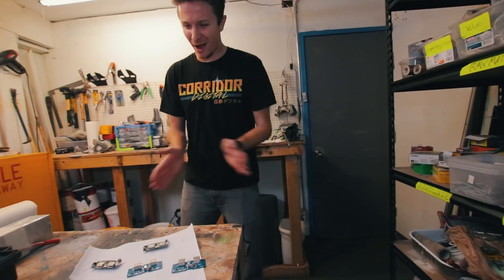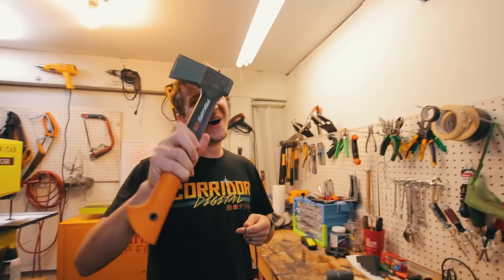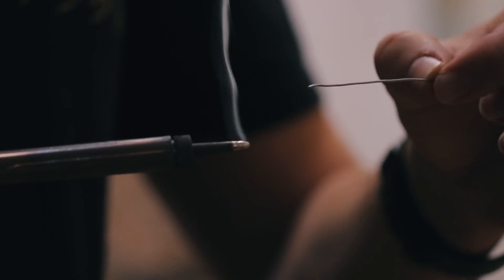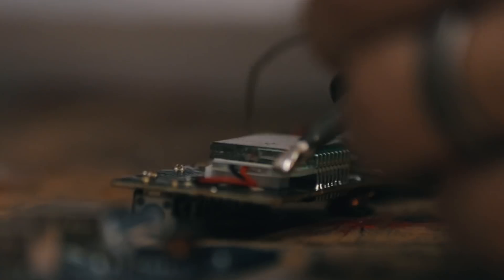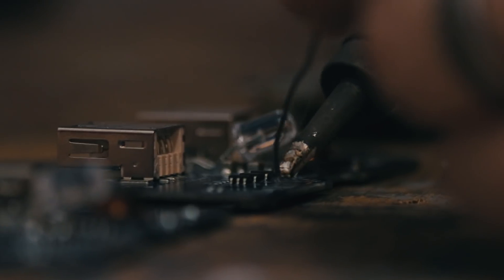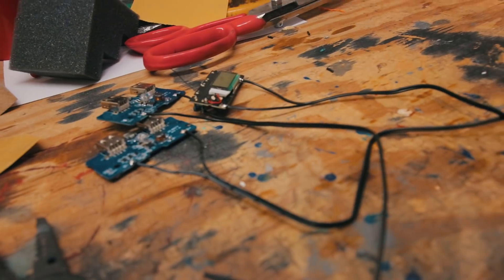A power bank of this size charging eight phones — that's kind of unheard of. The cool thing that allows you to do DIY battery builds like this is that you can buy USB chargers really cheaply online. Each little circuit board has two USBs along with a micro USB to charge. If I wire up four of these circuit boards with two USB ports on each, I can charge up to eight phones at the same time. I'm wiring each of these circuit boards together in parallel so they're all sourcing the same voltage and current from the battery. Last one — then all the little circuit board guys will be attached.